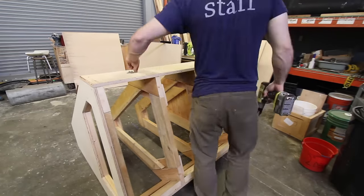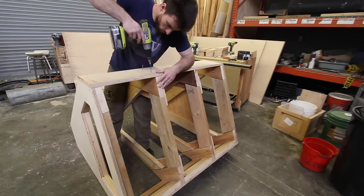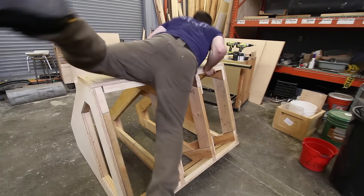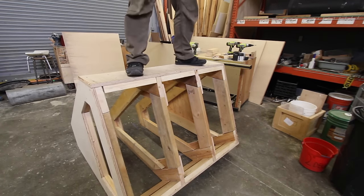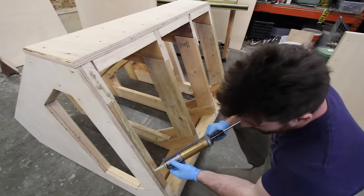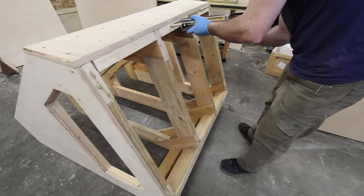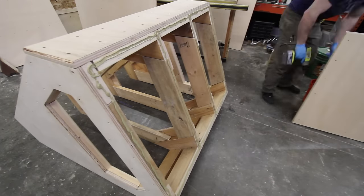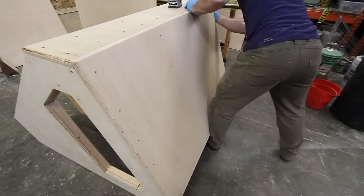Here I'm flipping over the first piece I put on because I of course put it on backwards. The whole thing is actually surprisingly rigid at this point, just being able to put in two good screws on each side of each of these. I didn't glue in the first panels because I needed to move around a lot, but for each other panel we put on we used polyurethane caulk — just a bead of it on each of the frame pieces before we screw it in.